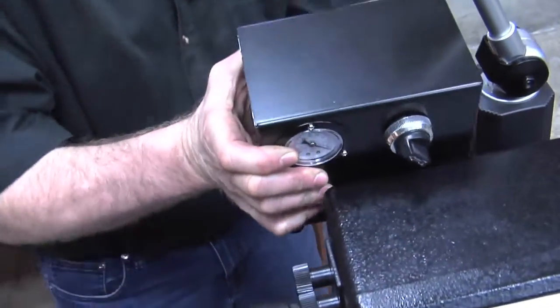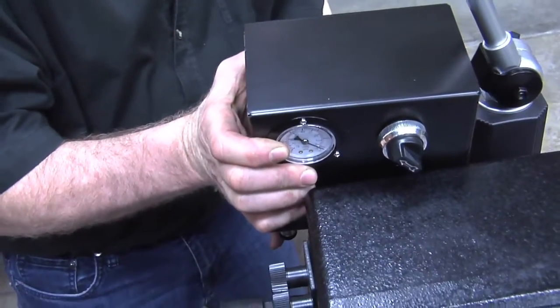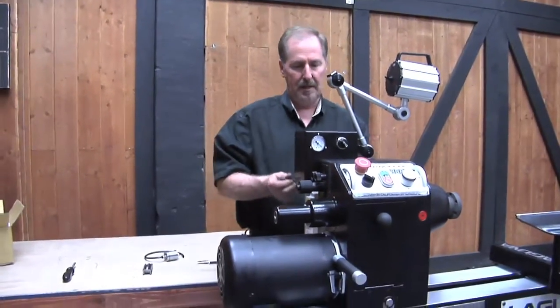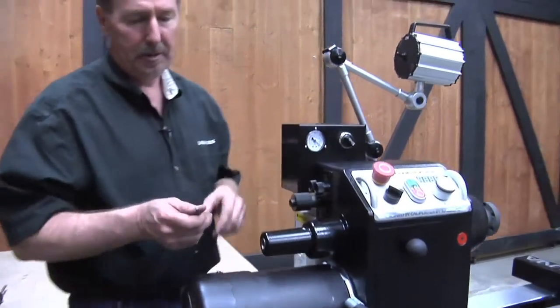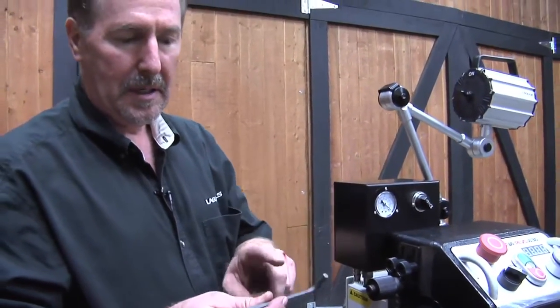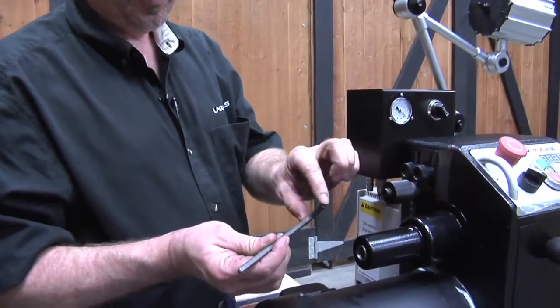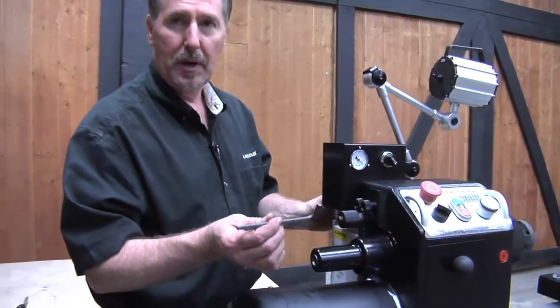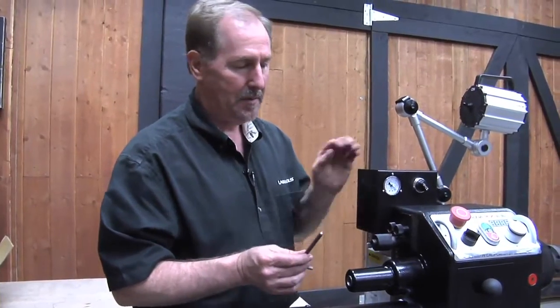Up onto the back, and let's start these two bolts. I've got this mounted to the headstock and just snugged up the box to the bracket. This is one area where using a long extension Allen wrench — or a short extension — is great because the space is a little bit tight. If you have a ball end, even better.